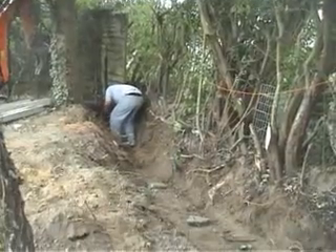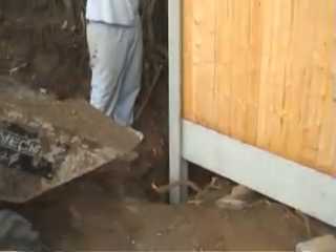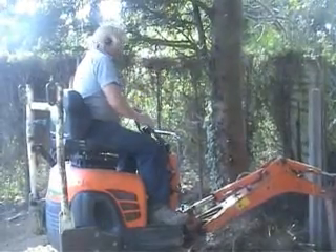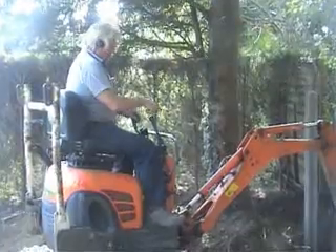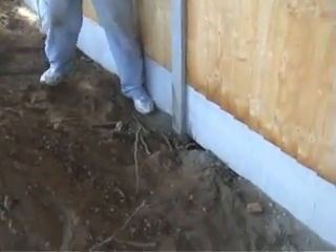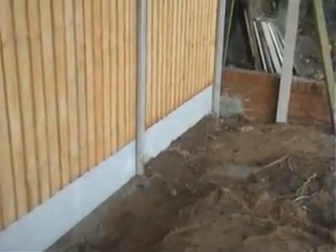He's already bought the fence panels here, and we might have to change them. We've got our first panel in — all dug post, all level. Sam's holding it up there, dumped full of concrete, ready to go in. Here's Sam packing concrete underneath the gravel board — digging the holes and putting concrete in and packing it in tight all the way along. That stops the gravel boards and the fence panels from sinking at a later date.